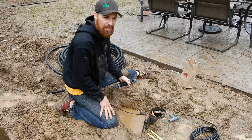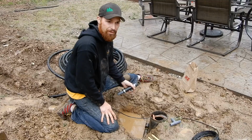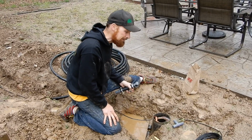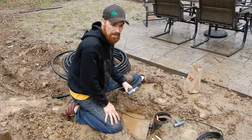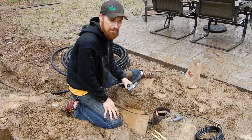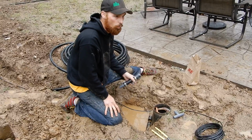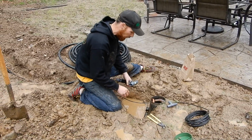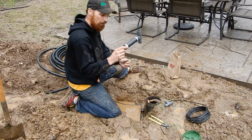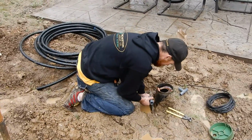And if you're going to do everything 1.25 inches, do everything 1.25 inches. If you're going to do it all 1 inch, like we do everything in 1 inch, put all the valves in one box, and keep everything that way. You don't have a bunch of adapters and different parts and pieces. You just have all 1 inch fittings, all 1 inch pipe, 1 inch valves. It just makes everything a whole bunch easier, and then we end up doing all this garbage to fix your mistake.